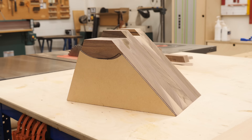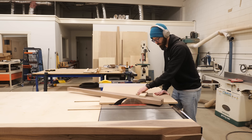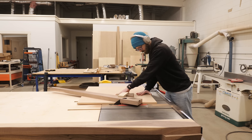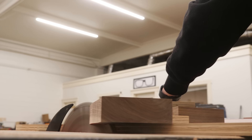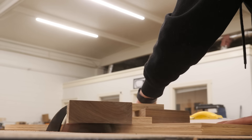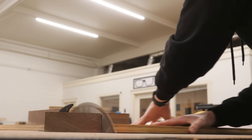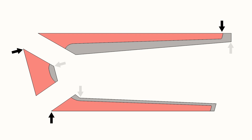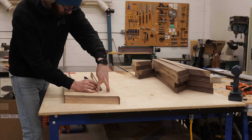From here it's really the same process to cut the joint faces on the top and bottom pieces of the assembly — only easier since we're just establishing the proper angle and the opposite ends are left long. If you've got a great miter saw setup, you could use that. At this point all workpieces are still way oversized — nice along the joint edges but still rough along the others. We're not going to bother refining anything yet; instead we can go ahead and glue them up into our sub-assemblies.